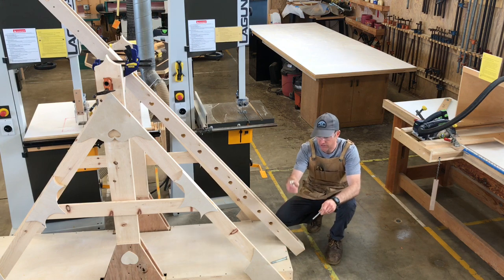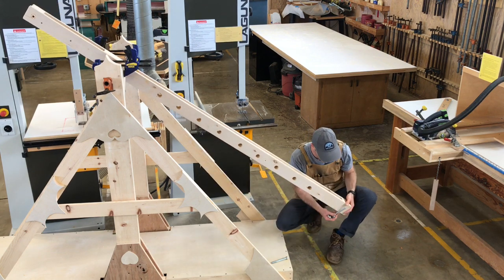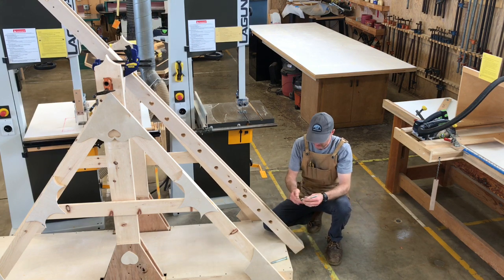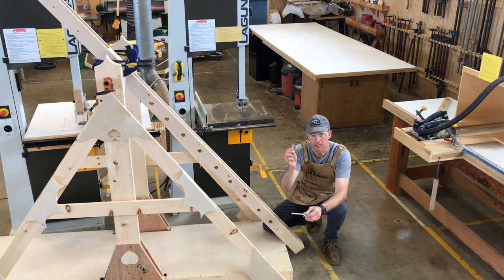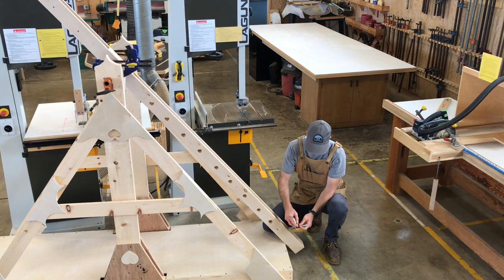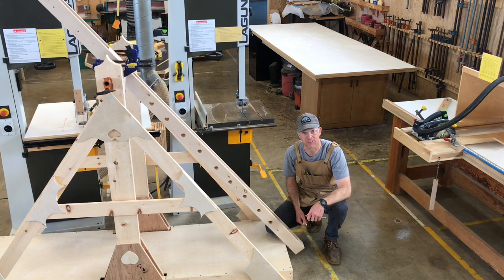I've got these guys right here. These are called eye bolts, and it's just a bolt with an eye on the end. What we're going to do is fasten one eye bolt on the end of our arm right here, and then fasten an eye bolt on the base of the trebuchet here. So they should be sitting kind of like this. Then we'll take probably just a normal bolt, tie a little bit of thin rope on the end of it, and have the bolt go through the eye bolts like this. So it's going to be stuck between those eye bolts. Then we'll stand back, and when the time comes, we can just pull the bolt out of the two eye bolts. It should separate them, and it should release the arm. So let's try this out and see if it works.